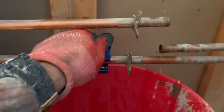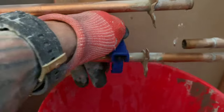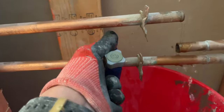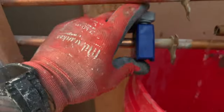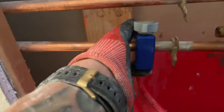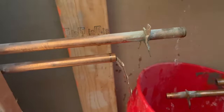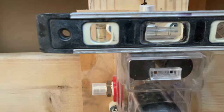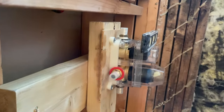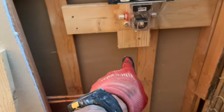Now we're going to cut these copper pipes and transition over to PEX material. All I'm using here is a tubing cutting tool — it's a multi-use tool, not too expensive, and you can find them at all your big box stores. I'll put some links for these tools in the description, but make sure you have a bucket nearby because even though the water is shut off, you will still have some water in those lines. I'm also cutting these pipes off-center because I'm taking into consideration the size of the transitions I'm going to be using — I do not want to stack them right on top of each other, so I want to give myself a little stagger. Then we're going to go ahead and mount the new valve, making sure everything is plumb and level. I use some spacing techniques to make sure it was appropriately aligned with the finished wall surface and that we had easy runs to all our water lines.